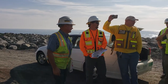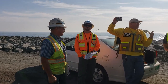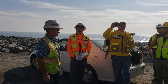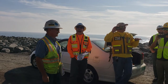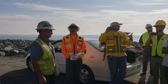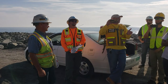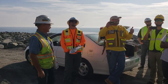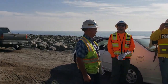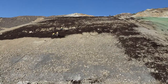The rule of thumb in California for construction projects is a bit different, but typically if you're working on your house or something like that, October 15th is the rule of thumb for the start of the rainy season. You want to have all your erosion practices in place — whether that's jute or a seed mix — before the 15th. A lot of agencies will require you to have your work done by the 15th regardless of when it actually rains, because historically that's when the first light rains would come through. If you put this down in the middle of summer when you're not going to get rain, the seeds will just be eaten by birds and nothing's really going to happen — so you want to put it in right before the rainy season.